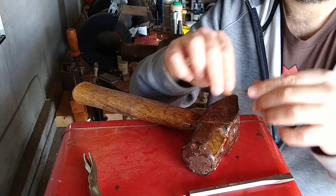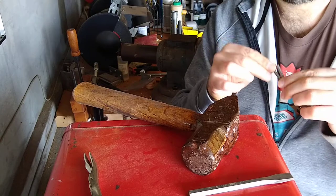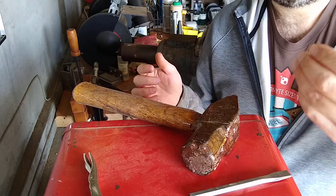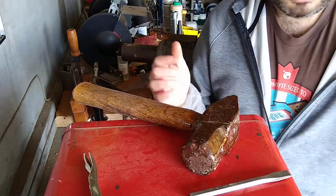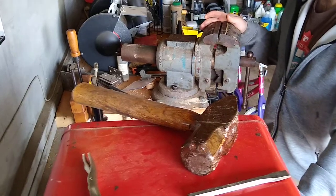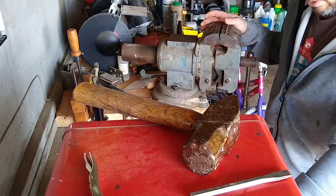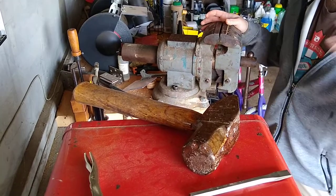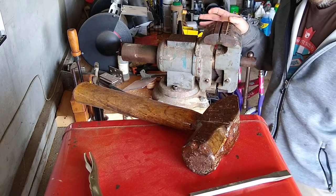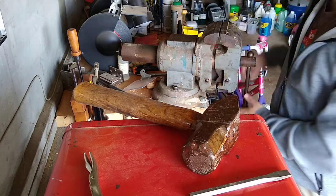Anyway, as you can see, you can cut metal without a power tool, without an angle grinder. It doesn't take long, whatever, we're taking 20 minutes here because we're talking, but maybe I'll get a better setup and demonstrate the speed. The big thing we learned is you want a steady surface. On the tool chest over here, which vibrates, the wheels aren't level. I have a lot of tools in it, it's relatively heavy, though not super heavy for a mechanic. The ground's not level, so I gotta chock it up or something. But yeah, just feel empowered.